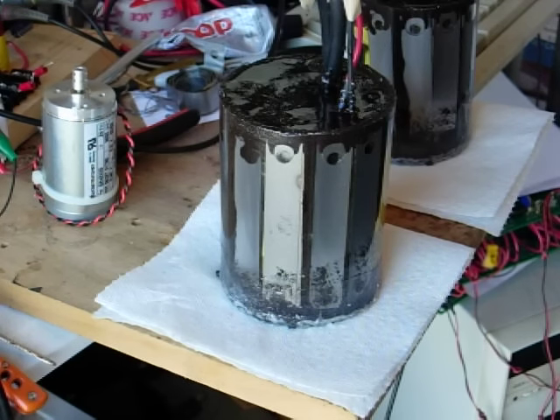My lab is a storage unit 8x10 right beside the railroad track, so I get hammered — sometimes a little shaky, but not today. Anyway, the 166 volt increase was actually from 120 to 166 because the other circuit was running the floodlights. It's interesting that once the large sodium tube was turned on, the voltage went up — the impedance had changed where the two caps were installed. So it's a matter of changing the tuning in the circuit that gave him the 166 volts. I suspect that with further tuning — use caps, whatever — you can really beat this thing up pretty good.